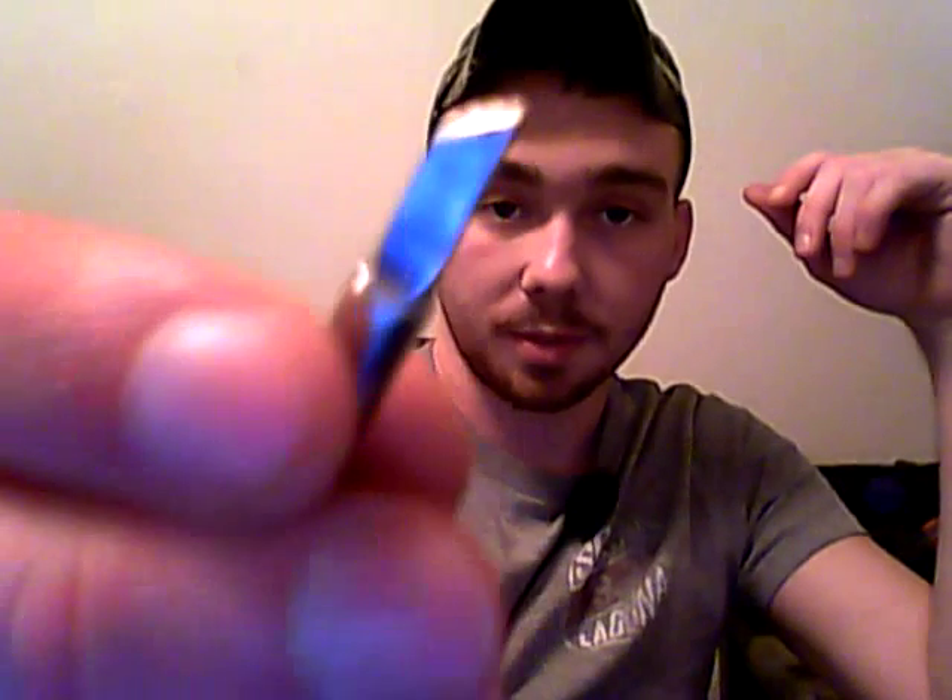There are a couple different kinds of tips you can use too — for instance, like this little chisel tip here. They work good too. You don't want to use a fine point because they just don't provide the surface area to hold the heat in. That's better for trying to solder something together and not take it apart.